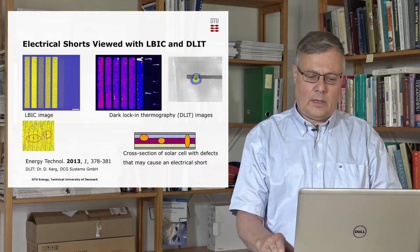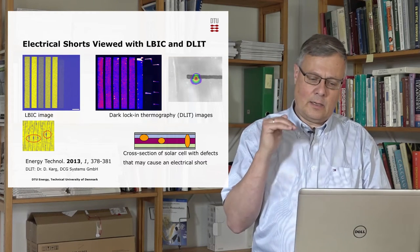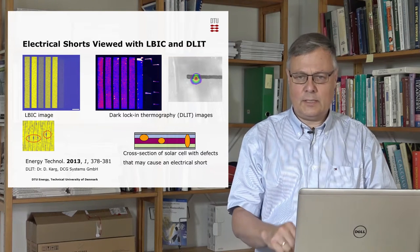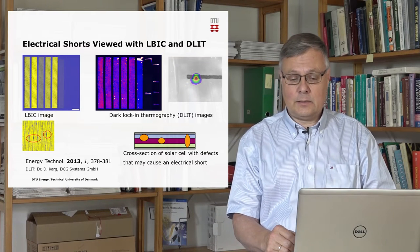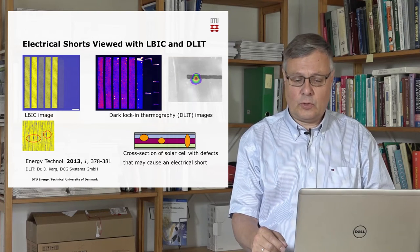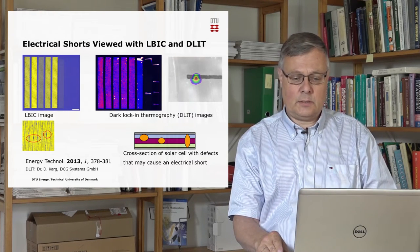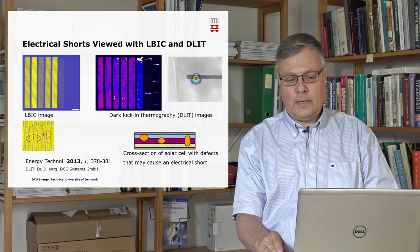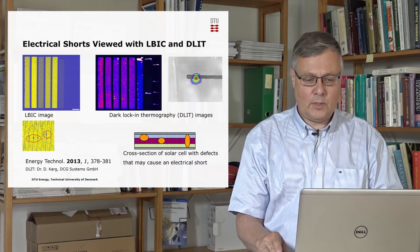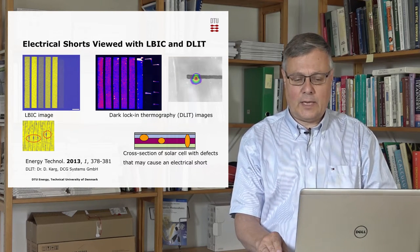If you look at a cross-section of an organic solar cell, you have a middle active layer and outside electron or hole transporting layers, with electrodes on the outside. Defects could be small metal particles embedded in the solar cell — the extreme example being a metal particle that spans the whole solar cell and connects the outer electrodes, which is what happened in those three deficient cells. Smaller particles give rise to less functional areas, as you can see in the blown-up ELBIC image, where smaller dark spots indicate impurities.